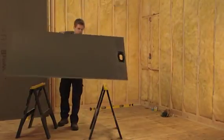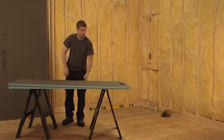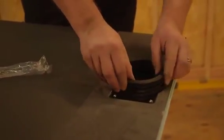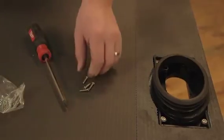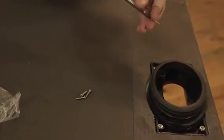The shower base always comes with a Rialito drain assembly consisting of two spacers used to align the floor tile with the linear channel once ready for tiling, an ABS trap for a cement glue connection to a 2-inch ABS floor pipe, and a sealing gasket to connect the shower base and ABS trap.